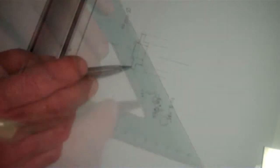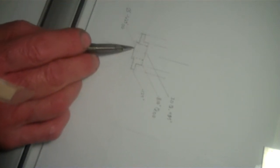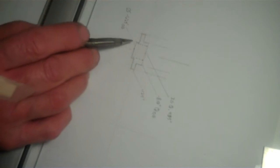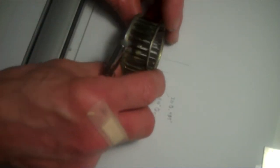And the flange itself is a thickness of 1/8 inch, 0.125 inches. The bottom part of this here is outside diameter at 5/8 inch, 0.625. We'll give it 5/8 inch there, and that will be the whole part made right there. That will fit inside here, and then we'll get riveted to this.